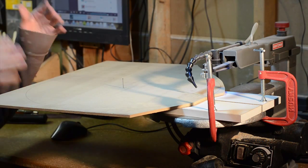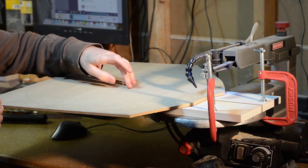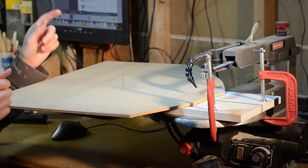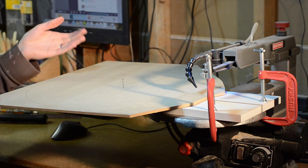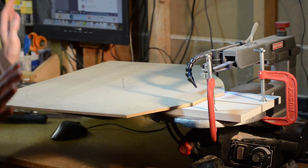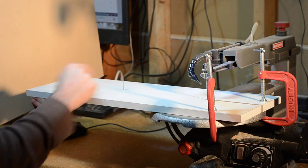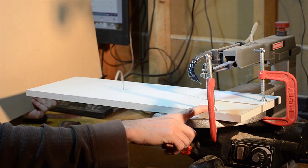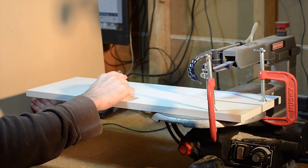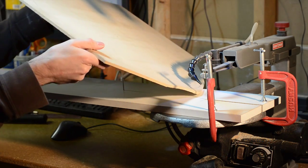Alright, so I need to cut out a large circle for the shield that I'm building. This is a trick that I picked up from my friend Harrison at Vulpen Props. He used a band saw. I don't have a band saw — I've got my scroll saw, but it should work. What I've got here is just a board with a nail in it that is clamped onto my saw, and the distance between the blade and the nail is half the diameter, or the radius, of the thing I have to cut.